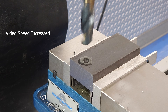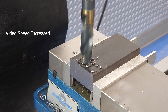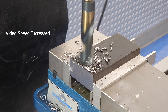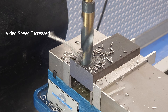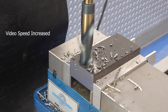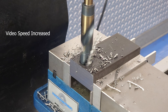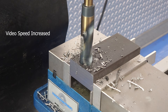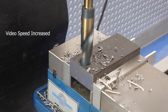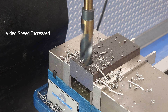Next is our final drill size. This is a three-quarter inch drill going through 1044 steel, and the 728 doesn't have a problem cutting a chip. It does have a problem at the end of the cut as the material stretches then work hardens that last couple of thousandths at the bottom of the hole. So if you need to drill a clean through hole with this larger drill bit, you will want to back your work piece with a piece of scrap to support the back of the hole. I'm kind of impressed that this small machine runs a relatively large drill bit at a fairly slow RPM.